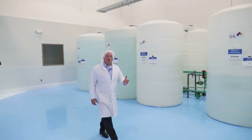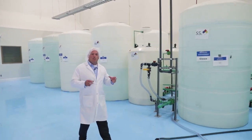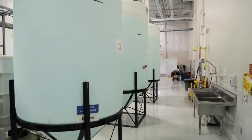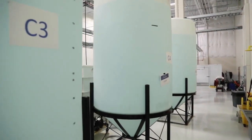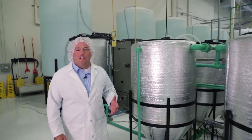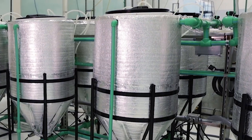After we've filtered the water to the level we need, we add our sodium chloride. In these tanks, a very specific level of sodium chloride is added to our filtered water. Once we have our solution in place, we go through a mixing process, and then a chilling process. These are our electrical processing units. Once we've reached the correct level of salinity and the right temperature, we can begin our electrical processing.